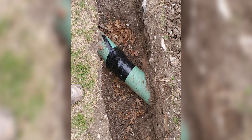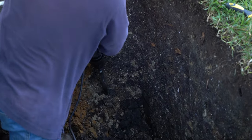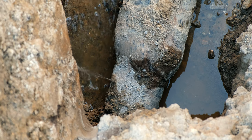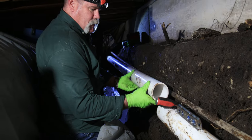Another issue is that in some cities, if your dig crew nicks a water line — and I don't mean makes a hole, I just mean say they're digging with a chipping hammer, which is actually a little jackhammer with a spade tip on the end, so they're not under there digging with shovels — but what if they hit a water line and put a dent or a nick in it? If the inspector sees that, he's going to ask you to change it, because that nick could create a restriction inside the water line that could lead to a leak later. That's something you really don't want for your customers. Another challenge of tunneling is access. Once we go in so far under a house, we want to try to make sure we've got another route of egress — an entry and an exit point somewhere else. That way, if anything falls in or you've got different people working in different areas, everybody doesn't have to stop just to get around them.